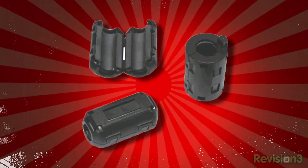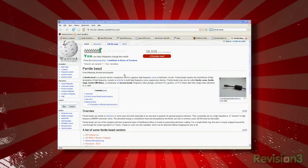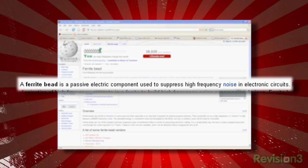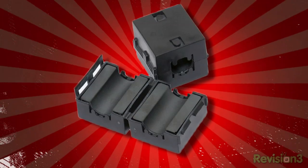Are those ferrite filters actually useful or are they just there for adornment? As it turns out, the ferrite beads, also known as ferrite cores or rings or EMI filters, do have a purpose. They're passive components that suppress high-frequency noise in circuits. They basically act as a resistor and dissipate the high-frequency energy as heat, though they're never really going to heat up that much so you probably won't feel it warm up.